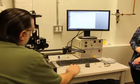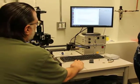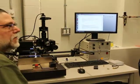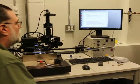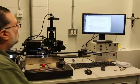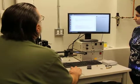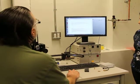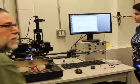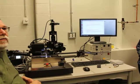I put it in right here, where is it? Process guidelines. So here's some gold to gold bonding. It goes through the different types of bonding, and it gives you some recommendations and starting points, what you should be aware of, temperatures and force. When you do gold to gold bonding, I don't remember. Yeah, let's see. It's 6. Okay, so if you're doing gold to gold bonding, it says 50 to 75 grams per bump. Depending on the amount of bumps you have, that would dictate how much force you're going to use during the process.